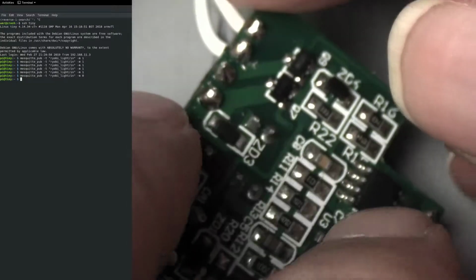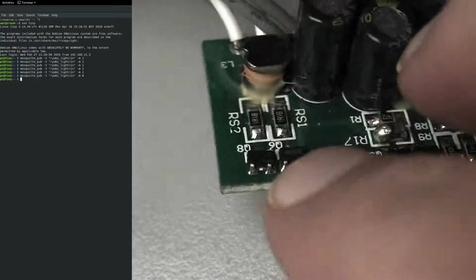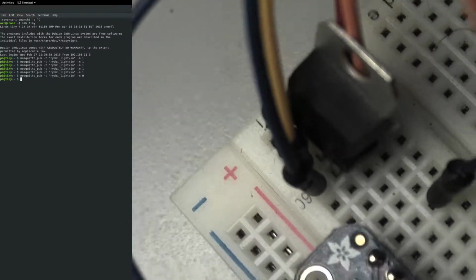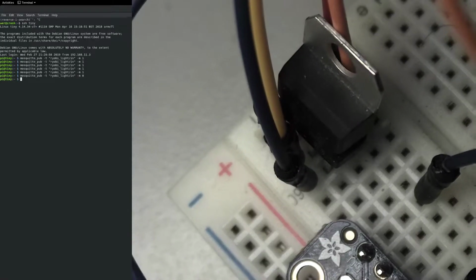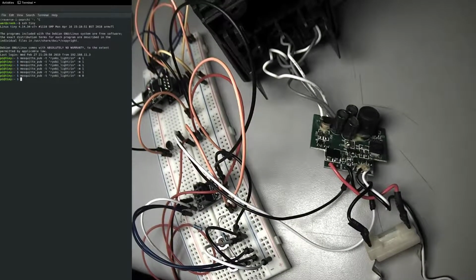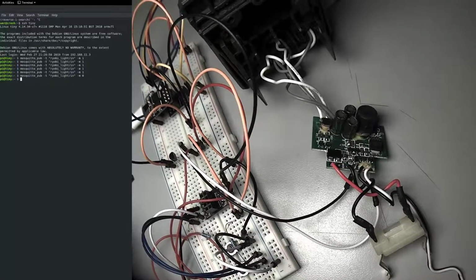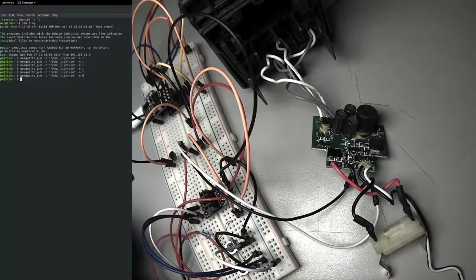However, when I started to think about it, at first I just thought, oh, I could just use this regulator that I already have, which is a big old, worst case scenario, big old inefficient regulator. But it actually peaks out at 15 volts, and I have 18 volt pack voltage. So then I was like, oh, maybe I could use a resistor divider, voltage divider. There you go.